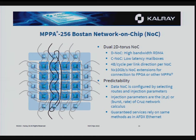Now the key part: you have the cores, you have the compute cluster. Now how do you get decent timing properties, decent performance and low power at the chip level? We do this by using a network on chip. And this network on chip is in fact a scaled-down version of a macro network. So it's RDMA capable. It's not doing load-store, but it's not restricted to send-receive. It does remote read, remote write, plus auxiliary signals that you can associate.